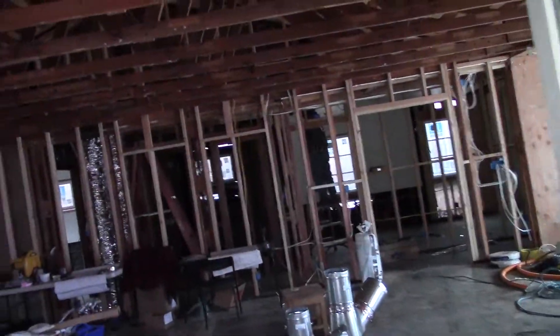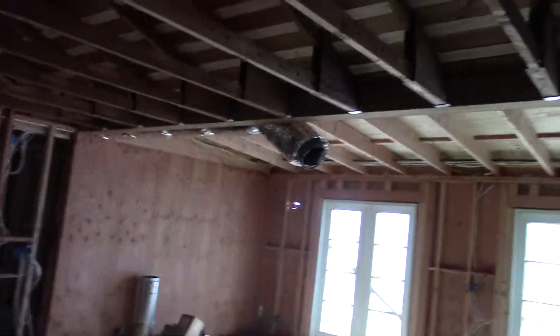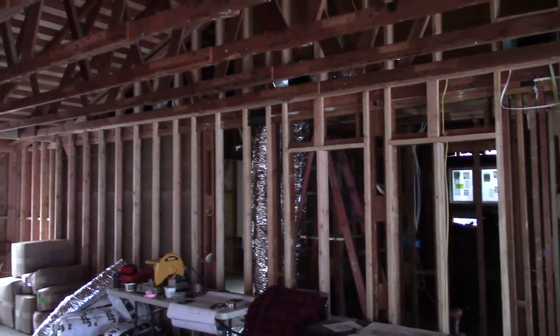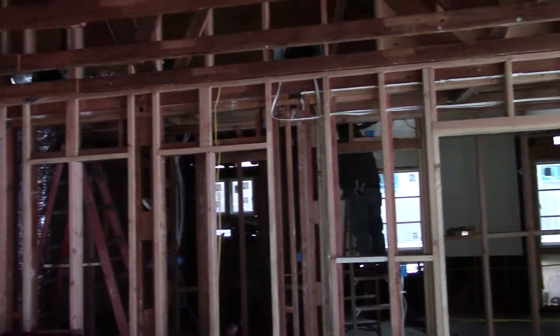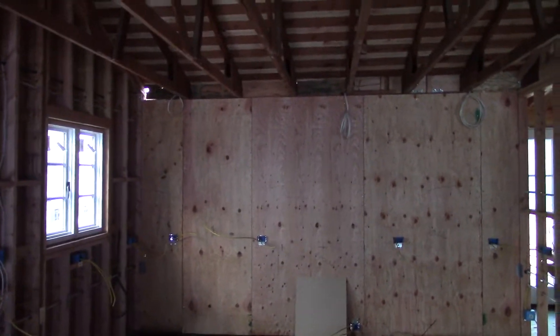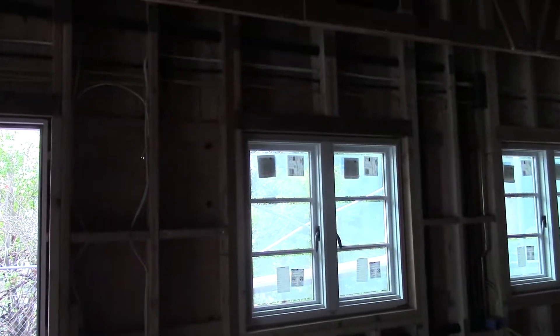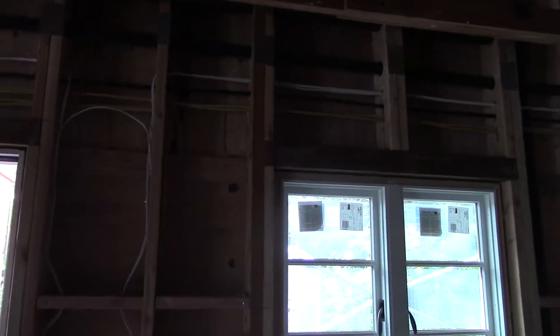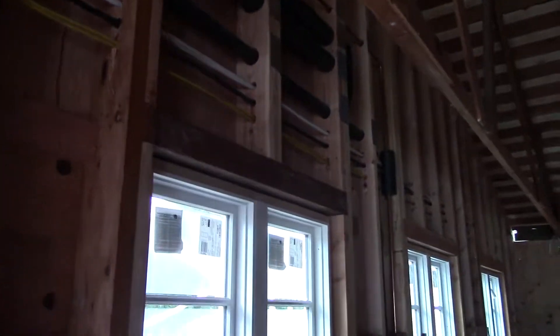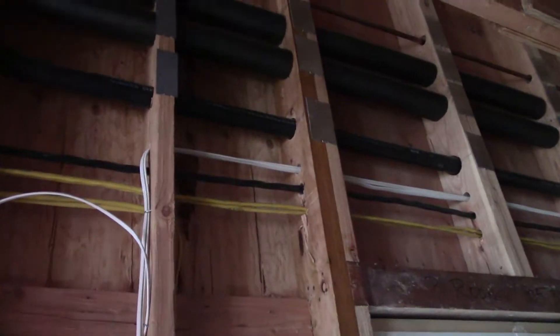Let's go in and take a look at the framing — Jim asked me to deal with framing. I've got new and old framing in here. The new framing is pretty obvious; that wall actually needs to be furred out. This is a shear wall — that's why we have that blocking. This wall is blocked because it's over ten feet to the plate. It's what we call balloon framed, which is what gable end walls should be — not western frame, because it creates a hinge on a gable end wall.